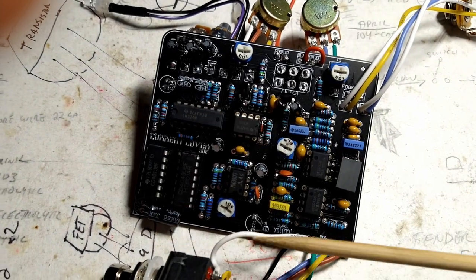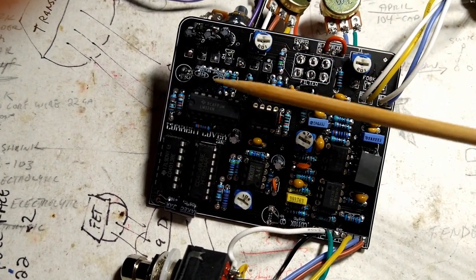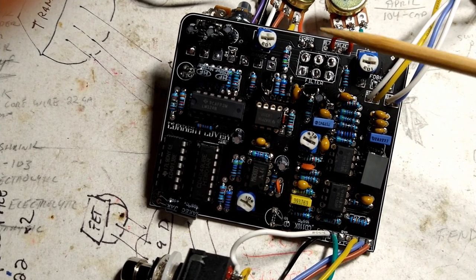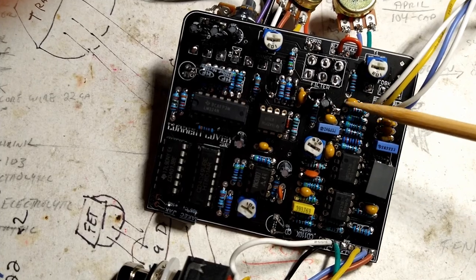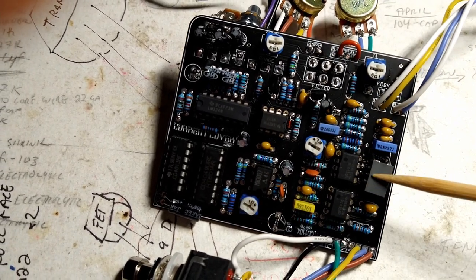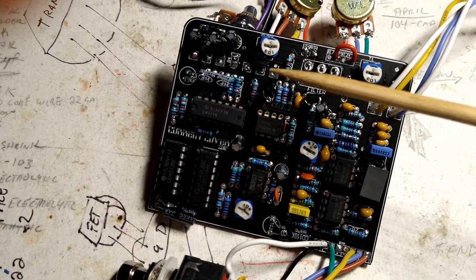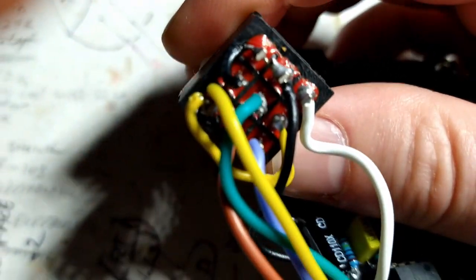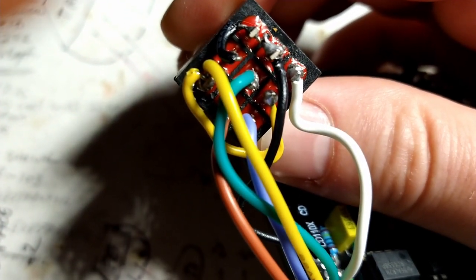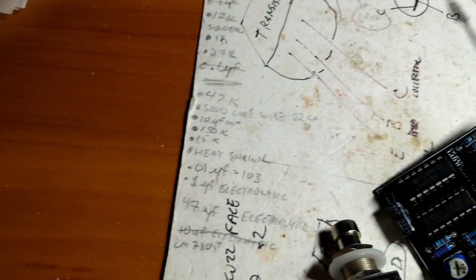A lot of times, if you were very careful and followed all of my advice, and you did things methodically, and you were very careful about making sure all your components' right values went into the right hole, and you followed proper technique for soldering, then some very common problems happen. A lot of times, like if you use stranded wire here, on the back of this, there might be like one little teeny tiny strand bridging two terminals. That could be a problem.